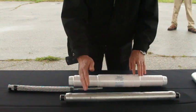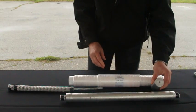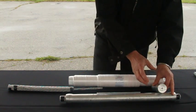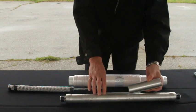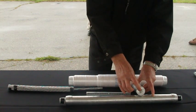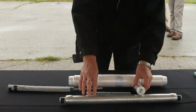If we take this sleeve and look at the cross section, we can see immediately what actually happened in the middle. All the metal — the aluminum conductor, aluminum sleeve, and the steel — is now compressed to a solid mass. If we look at the side of the steel sleeve, equally the same results: we have the steel core, the steel sleeve, and the aluminum being pressed together to give a uniform, solid mass.